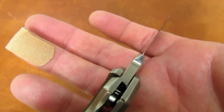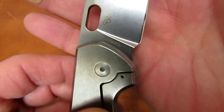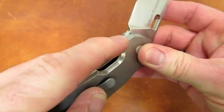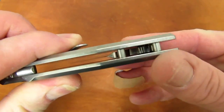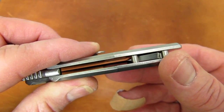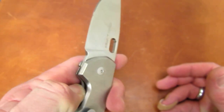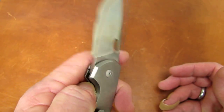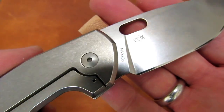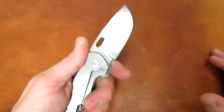If you come in close here, you can see that I have enhanced that Ricasso just a little bit. And guys, if you're going to do that, to make it sharpenable so you get that nice, pretty straight edge all the way to the back, you better be careful, because watch this area of the blade as I close the knife. You watching? Look where that closed stop pin hits. You really got to be careful. If you take too much material, you're going to have a knife where the detent hole drops past the ball and it might start hitting the backspacer. I had to be very careful. I think it looks pretty factory unless you know I did it and you're looking in exactly the right spot. So, a little bit of a challenge there, but no hill for a climber, as they say.